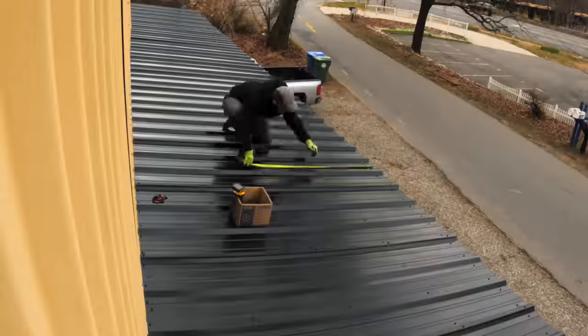The last metal bits to add to the roof were the end wall flashing pieces. These tuck up under the metal siding and help to move the water from the siding to the roof. These flashing pieces were absolutely massive, which made working with them pretty tricky. On the first piece, I wanted to add a one-inch-wide bent flap so the flashing would wrap over the edge of the gable trim, and this was definitely easier said than done. Even with my hand seamers, I didn't end up with the cleanest bend, but I came up with another method which I'll show at the other end of the roof.